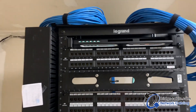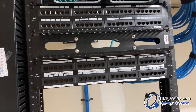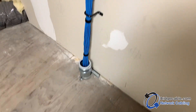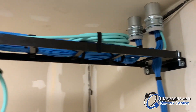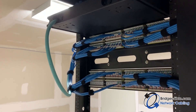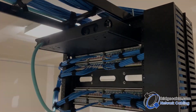We have a fiber tray up here, patch panels in here. Typically we'll put a 2U space there for future use, depending on where your switches are. We have a bolted-down rack that isn't moving, a sleeve, and a couple drops going down below. We have D-rings — organization is magnificent. We have the sleeves up top, service coil fiber up there in case you ever need to move it. We have a cable tray and enough room to walk right into the back. Always make sure you have a minimum three feet of clearance. D-rings, sleeves, and punches — that's it for this installation.